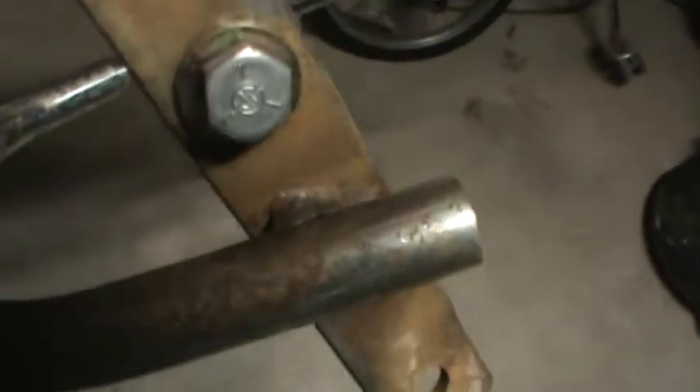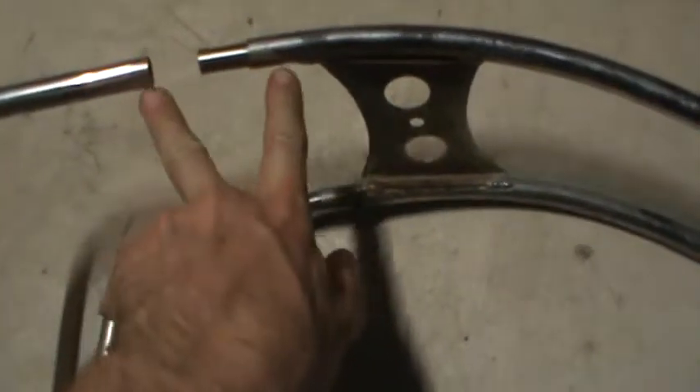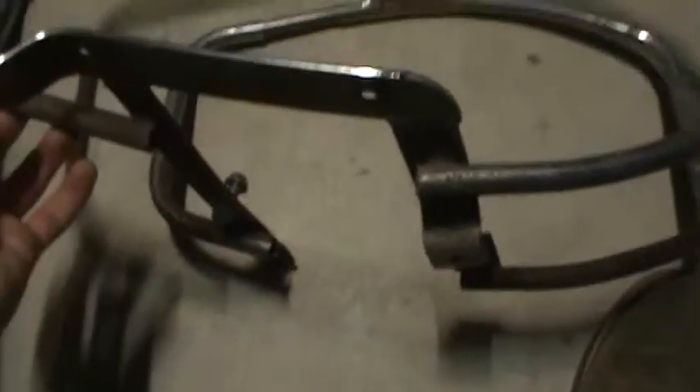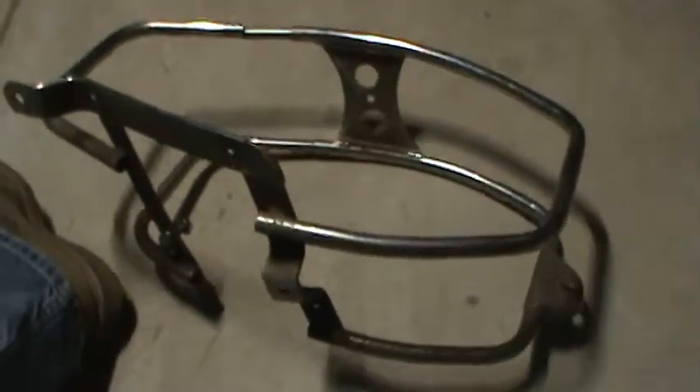And there's some cracks in them — right there you can see a crack, and it's cracked on the bottom also. So I've got to weld those up. And then somebody cut a piece out of this side, top and bottom — there's a big piece cut out right there, and then this piece cut out here, I guess to clear something on whatever they had them on. So I went and got another steel piece of pipe, cut it to fit in there, and I'm just going to weld them up and then spray paint them. But these things are pretty rusty, so I'm going to have to take some steel wool and clean them up. I think they'll clean up pretty decent. They're not going to look brand new, but they're going to look good and they're going to be functional.